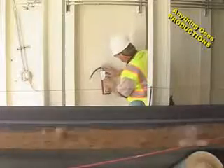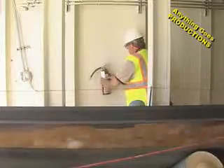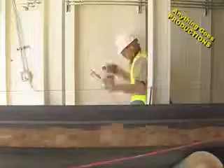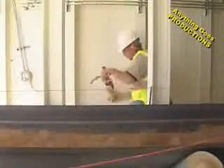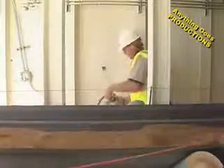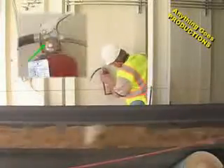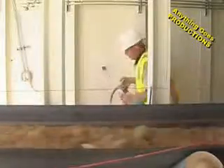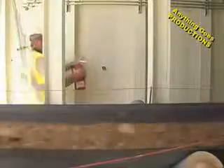Step 3: check the hose for obstructions. Step 4: check the mount. Step 5: remove the fire extinguisher and invert it five times. Step 6: recheck the gauge. If the gauge has moved any from the previous inspection, replace the fire extinguisher because this one's ready to go bad.